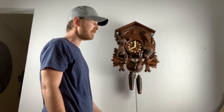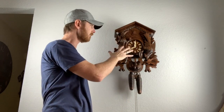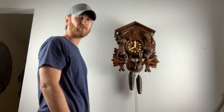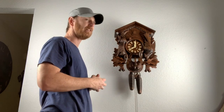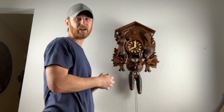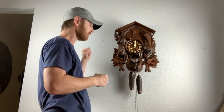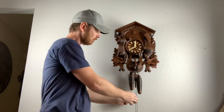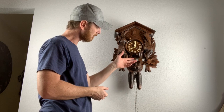These clocks do need to be cleaned about every three to five years. The chains take on a lot of dust and it gets pulled into the mechanism. This one's in pretty good condition — I've fully cleaned and serviced it. Generally your cuckoo movement is going to be good for about 15 years, maybe 20 if you have it serviced regularly. Sometimes they'll surprise you and go longer, but those are little pieces that get worn out from all the action and dust. Try not to put it near a back door or a fireplace, and avoid walls with a lot of rattling — it's not going to help your clock. When you pull those chains, make sure you're pulling straight down and just need a couple fingers of clearance.